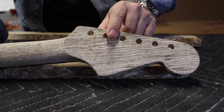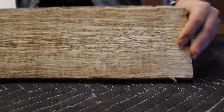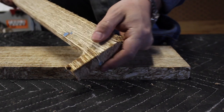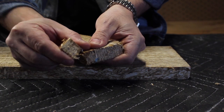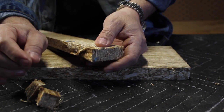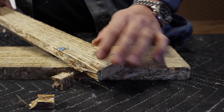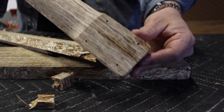One of the issues with hemp wood is that it is quite brittle. When you have a piece this big it's not an issue — you can't snap this in half. But when you start getting into thin pieces like this, you can. So right here, this is your standard neck blank, close to 19mm — I can just snap it like that and keep doing that. Very scary when I was CNC-ing this. This is where the locating pins were, and I could already see it was becoming quite fragile. So I flooded both ends with super glue, which helped stabilize it enough to get the proper heel going.